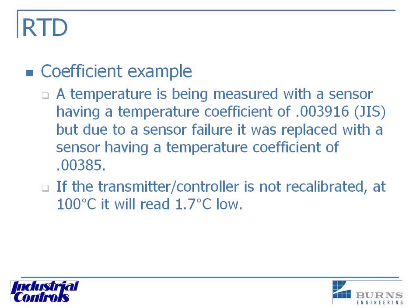It's very similar to a thermocouple — if you have a type J thermocouple but you're running type K wire, you lose your accuracy. The idea is choosing the right unit, choosing the right sensor, and getting it accurate all the way through. If you're trying to heat a process to 100 degrees C and your sensor is reading 1.7 degrees low, you're going to waste a lot of energy and actually be over temperature. We're here to save you money and make you money — and it's all done with accuracy.